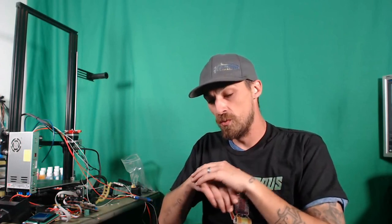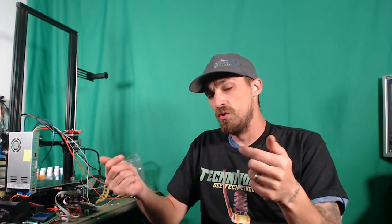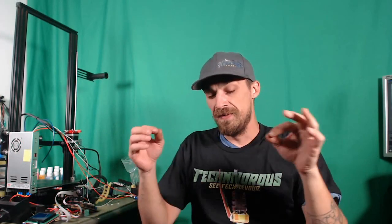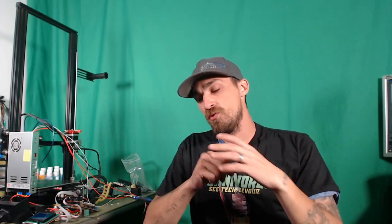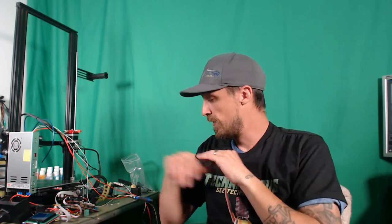We will have more on this beast — I'm very excited about it. One gentleman gave me an idea about running a bracket between the two empty holes on the extruders, which is a very good possibility. I think we're going to create a bracket that goes across all four holes to brace it a little bit better. We'll screw through the two that we're using to hold it to the plate, and then screw through the other two just to hold it steady. Next time you see me doing the Ender-3, we should have that bracket ready and our new Arduino Mega, which will put us a few steps closer to our goal of a dual extruder.